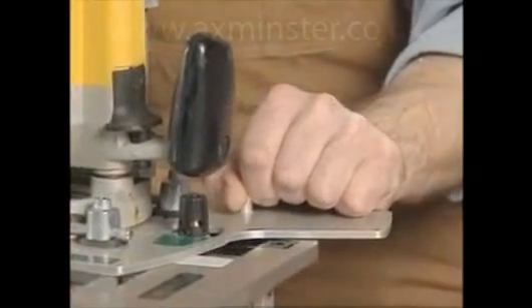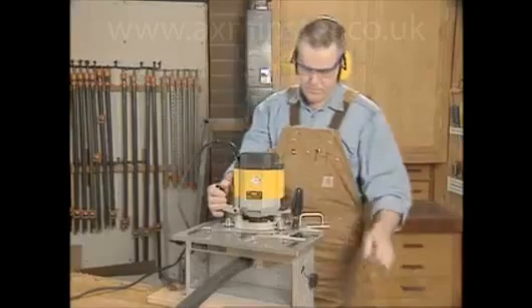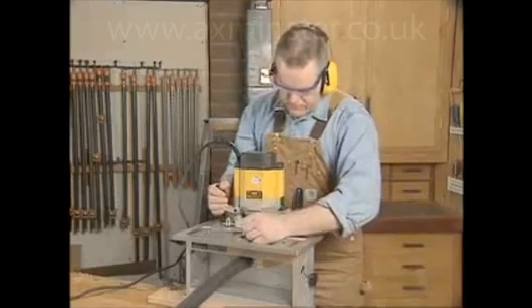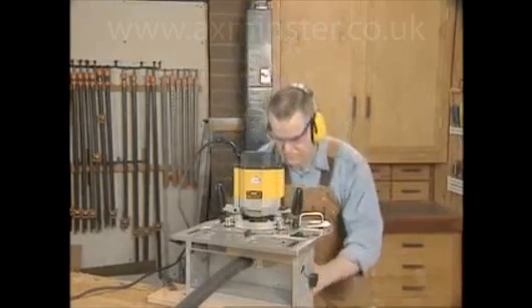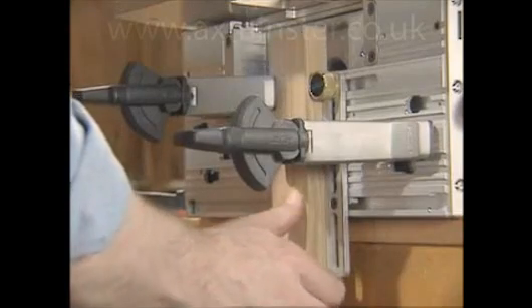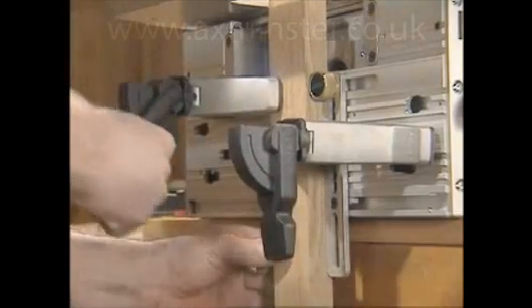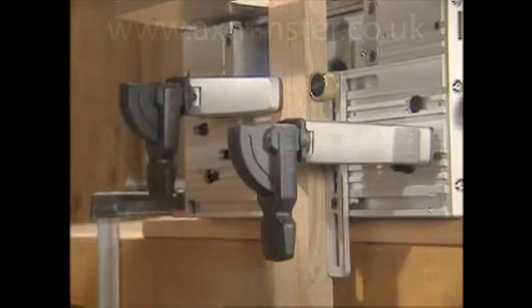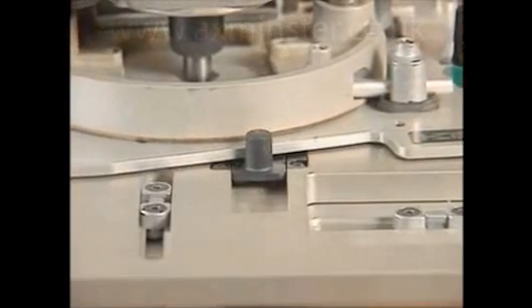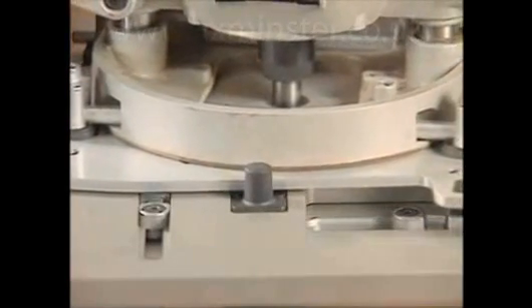Then for the finished cut, route counter-clockwise with the pin running on the guide. The sight is moved forward, the workpiece turned over and slid up to touch the sight. If you forget to retract the sight when cutting tenons, the router sub-base automatically pushes it back into place.